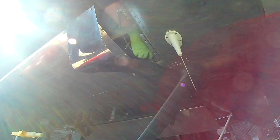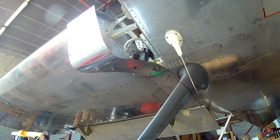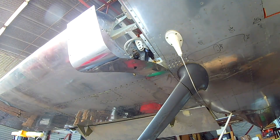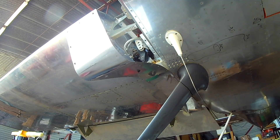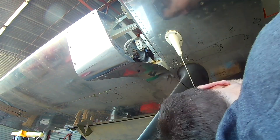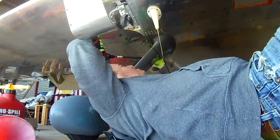The number two pump wasn't making full pressure, which was weird because these pumps are supposed to do 50 pounds on their own without restriction. We have ours restricted to 35 pounds, so they should at least make 35 pounds. So I totally took the whole pump housing off, which was a gigantic pain — took three hours to get it out.